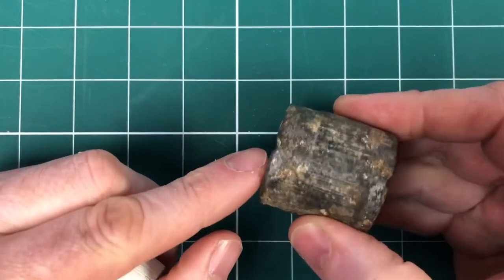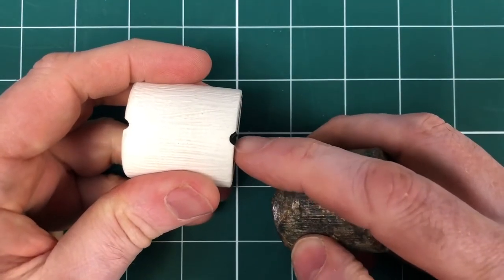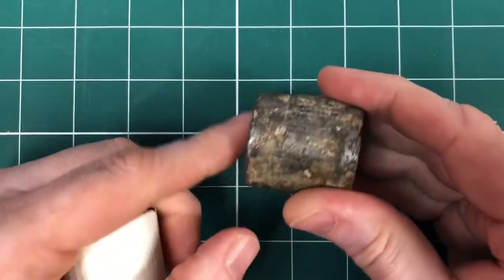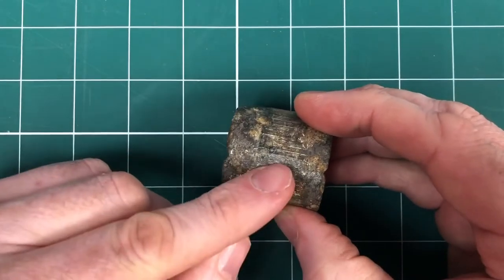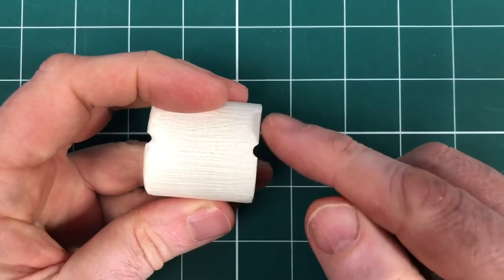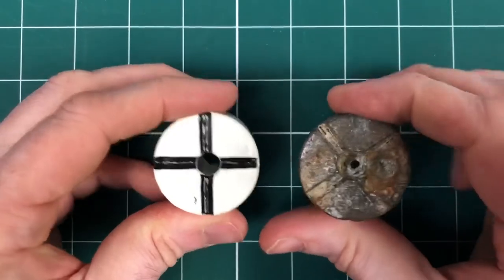So what we think the manufacturing process was, was to drill these holes in the whole piece and then cut down the centre of them. So if this was made in one piece by having the hole drilled, and then both ends sort of turned around so the flats are on each other, and then brazed together. We've made this alongside another piece with some excess on each end, so that we could drill through and then cut the holes. So we've tried to replicate it in the right way.